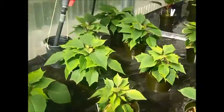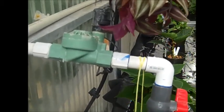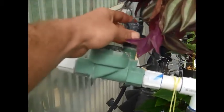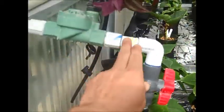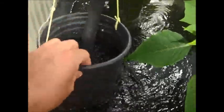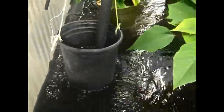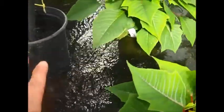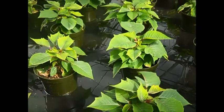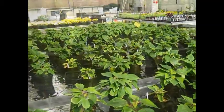This system is automated here by a valve — it's got a shutoff valve hooked to a timer. When a little current of electricity runs, it opens the solenoid. I'm going to mimic the opening of the solenoid and water starts to flow through this three-quarter inch setup, coming out here into a pot because these are moving tables. As the tables move, we want the pipe to drag and move along with the table, and then the water flows out onto the table. It's a great system — we use it for geraniums in the spring to keep water off the flowers.